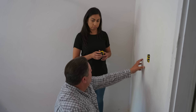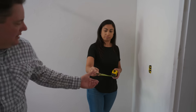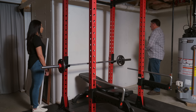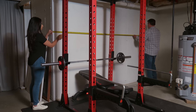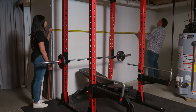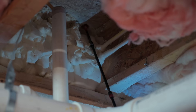I want to go down there and drill up to make sure we can get into this wall before we cut a hole in the garage and make a mess that we have to patch. Let's see how far off that wall we are. What do you have to the middle? 108 inches. Our original number was 108, and I'm adding for the thickness of the wall, so that puts us somewhere right around here. It looks like it's unobstructed and we should be able to get up there. So I'm going to go ahead and drill that hole, make sure we can do that, run the wire, and then I'll come and get you in a little bit.